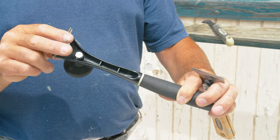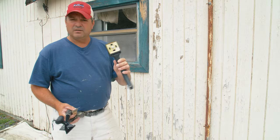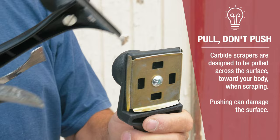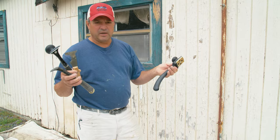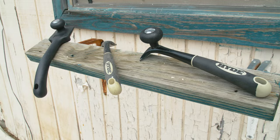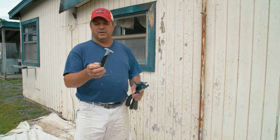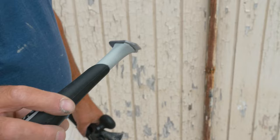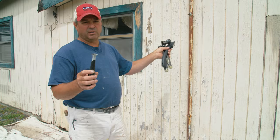They also have the same tool without the handle — a bit more streamlined, fits in your pocket better, which is nice when you're on a ladder. They also have a four-sided carbide metal scraper with a fairly dramatic curve to the blade, which comes in handy when scraping clapboards that are cupped — it nests right into the clapboard nicely. There's also a contour scraper with a variety of differently shaped blades you can attach to the handle, which we'll use on this T111-style siding that has a groove in it.